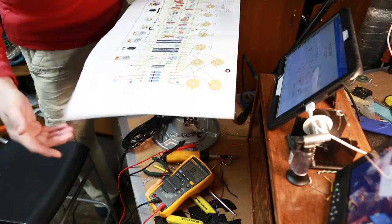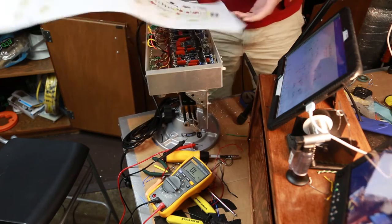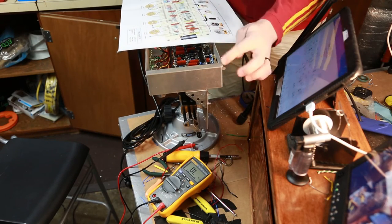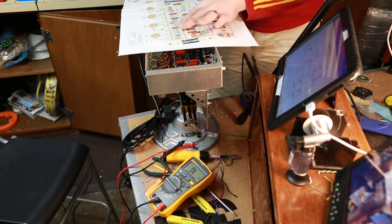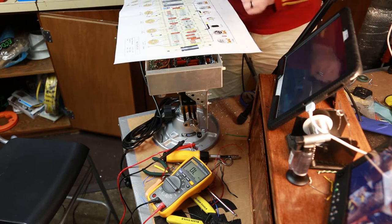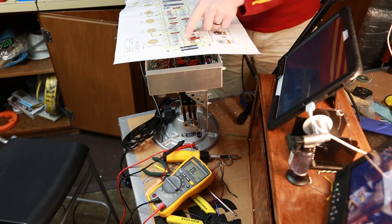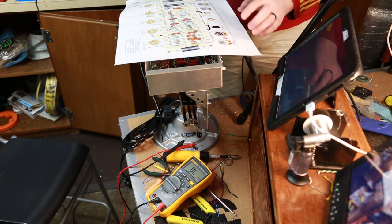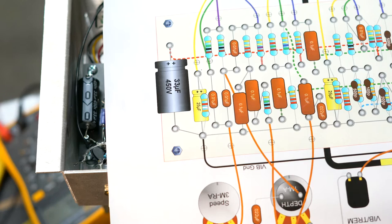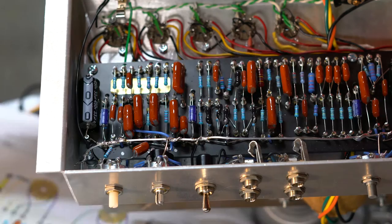I've shown this before. I'm gonna try and put that visible. I'll effectively be starting with this layout set up this way — you'll see there's a large capacitor here and a large capacitor here. I'm gonna go through and check every component to make it match. I could in theory look at the layout, except I'm not great at reading resistor bands and almost always have to keep checking back with the schematic. But I've got both of them, so I can look at what goes down to the ground of the footswitch and up off the speed pot.